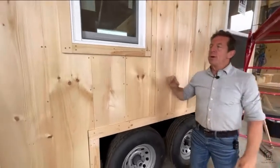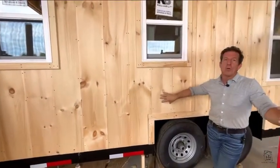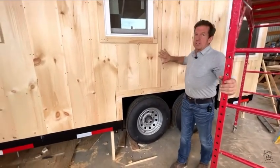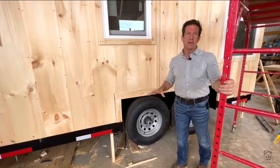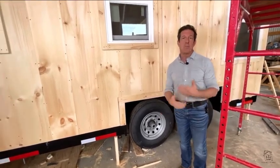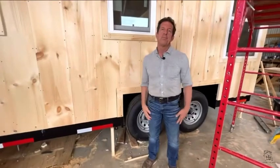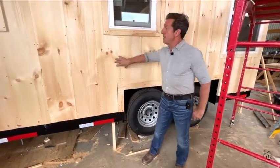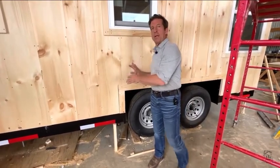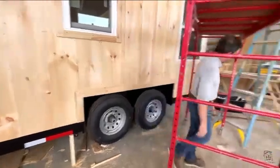Now, the reason we moved away from wood — we'll still do wood on our customs, because we're still building custom homes on our schedule. But if this home went to a massive dry climate, like Arizona, Southern California, or Nevada, this wood, because of our temperature and moisture content here, makes this stuff move. That's why we said we can't warranty this wood anymore — we've had so many homes we've had to go back and replace. If they're built and left in the eastern or southern part of the United States, we're good. You would have to take the wood and set it in Arizona and let it acclimate before installing it. The moisture content has made it move.